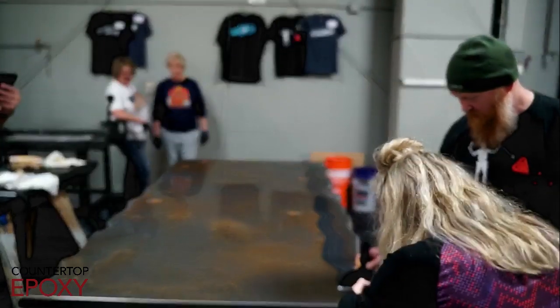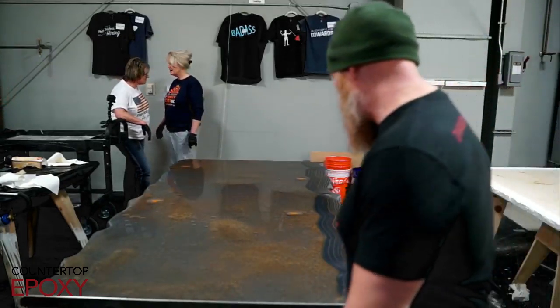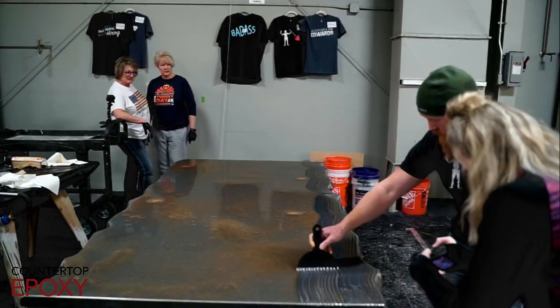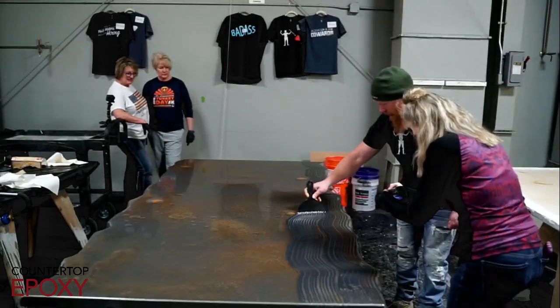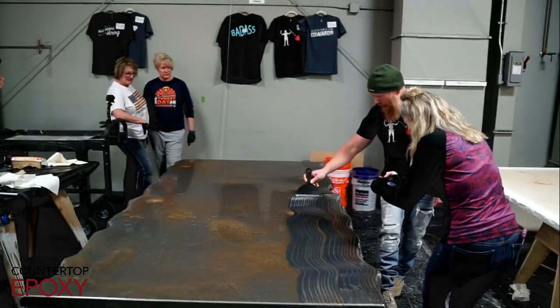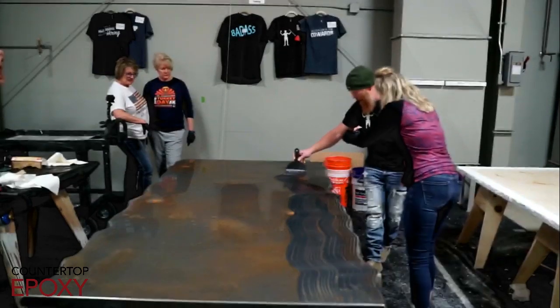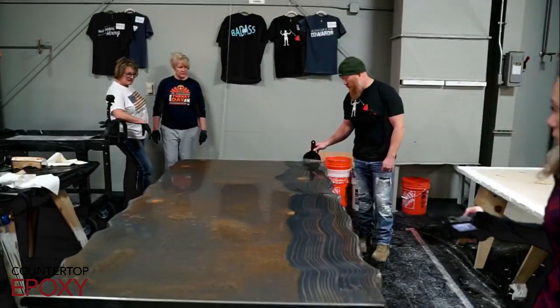So he's just scraping that color in. Taking that notch tool, he's going to drag it down. When you're doing grain, your goal is to get those colors completely worked in, so that as you sand and work it more, it gets really integrated into your base color. It gets really buried, so tomorrow when we sand it down, it's really going to uncover a lot of that grain. He's going around the knots, making sure that the wood grain looks the most natural.